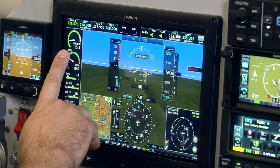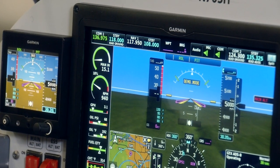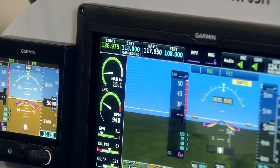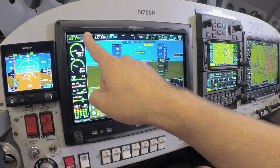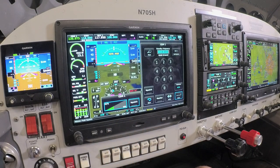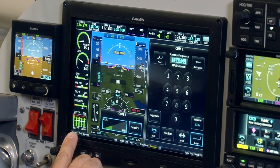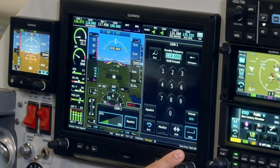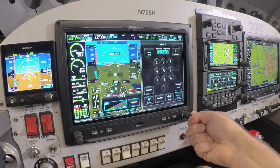In the top left corner, we have options for comm radio control. This multi-function feature of the G3X Touch screen can control either a remote-mounted comm radio or a panel-mount radio or one of the GTN IFR navigators — it's a very simple interface to use. By selecting the standby frequency on the primary flight display, it will bring up the split-screen multi-function display controls for the comm radio, and the dual concentric knobs change their function. We now have volume and push-to-squelch, as well as tune frequency and hold-to-transfer. From this page, you can tune a comm radio frequency like a traditional panel-mount radio.